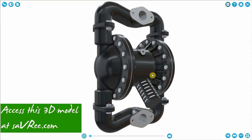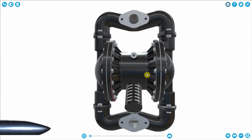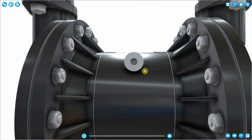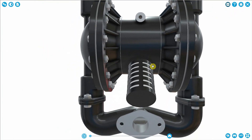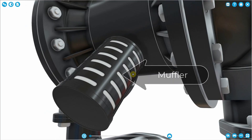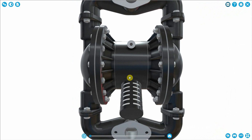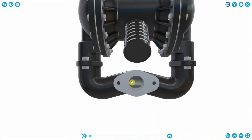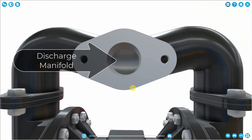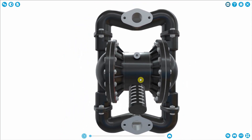Let's run through the parts briefly and then I'll show you exactly how it works. There are two things that are flowing through our diaphragm pump. Compressed air is one of them — it flows into the diaphragm pump through this connection here, and it flows out through this connection where my mouse is now. This particular part is called a muffler. The other thing flowing into and out of this pump is the process fluid. The process fluid is drawn in to our suction manifold through this center hole here and discharged via our discharge manifold through this center hole. So process fluid going in and out, compressed air going in and out as well.